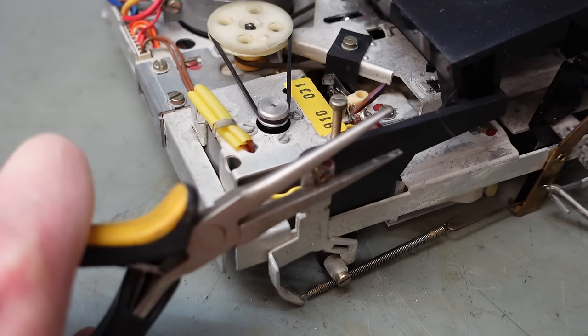It does require 2 separate oscilloscope probes. Put one probe on here, and the other on this side. And I don't need to add any more grounds because the audio output's already grounded to that scope over there. So I'll turn on the maths menu, change the waveform definition. I want to use dual waveform maths. And I want to set the operator to negative, that's fine. Subtract one from the other. Okay. Create the maths waveform. That's what we got. This line here is showing the difference between channels 1 and 2.